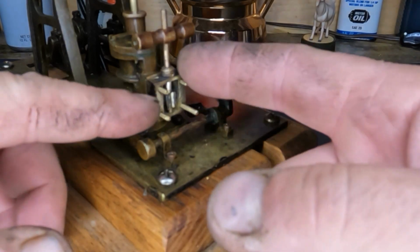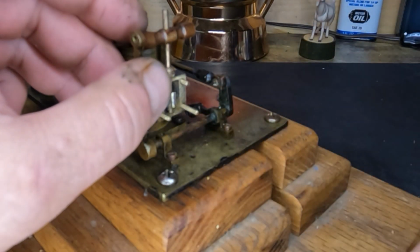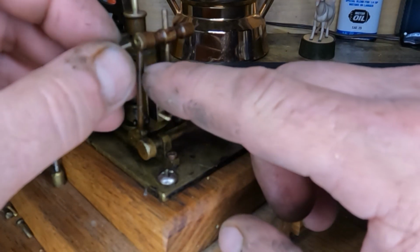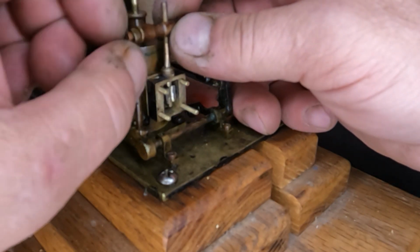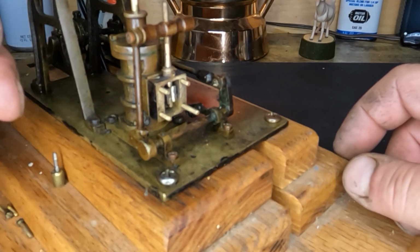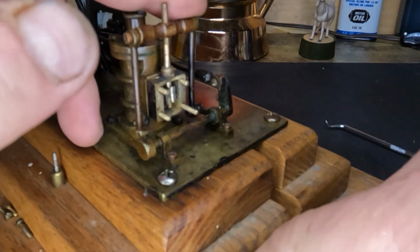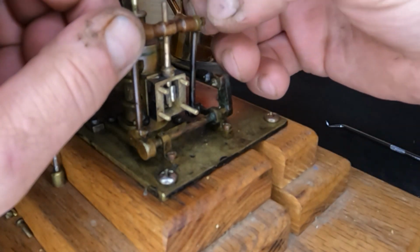Okay, well, we got our valve chest back together. We've got it kind of ballparked in on our timing. You guys can't see anything, I got my hands in your way. So what we're going to do is hook up our valve linkage here, put these screws back in, put our valve chest cover back on, and oil this up. We are going to leave our packing nut back off because we're going to have to get back in here, guys, but we want to make sure that everything's going to work. So let me get this other screw back in. We'll get our cover put back on front of our valve chest and we'll throw some air to it and see what we've got.